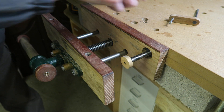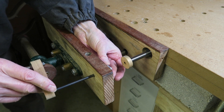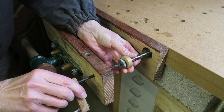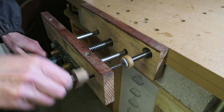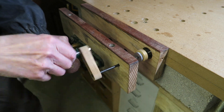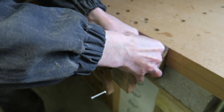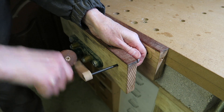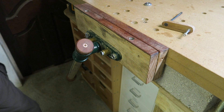The way I put it back is I've made this little lock nut that fits on the thread there, so bung that in there, lock it in there, and then wind that back in. It just so happens that thread is from an old lathe slide and it's left-handed, so wind it back, undo that — seems to work, but maybe not as quick as some of them.